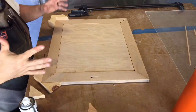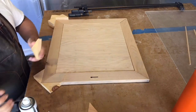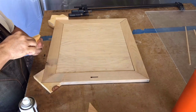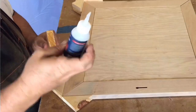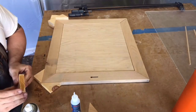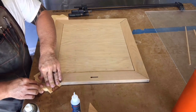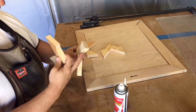We've got our miter frame here, now we get ready to glue and clamp it up. We had a bunch of these triangles so we're going to try some clamps here and see how they work out. First we put our CA glue on — we use Star Bond, this is Star Bond medium. Then put accelerator on there, line it up where you want it, press and hold, give it a few seconds to grab a good bond.